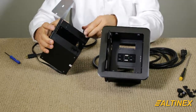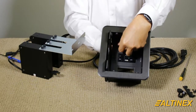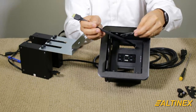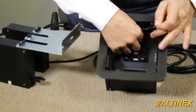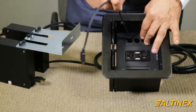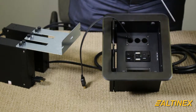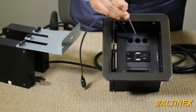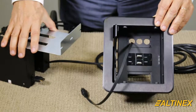I'm going to show how we feed this through. Once it's installed into a table, you're going to feed this retractor right through here, and then mount the two brackets that will hold the retractor. They're all mounted from the top, so there's no reason to do anything under the table. As you can see, we now have a retractor cable going to the opening. Secure it with a screw — you're going to need four of them, two on each side. One side is installed; you will do exactly the same thing on the other side.